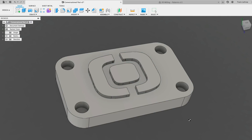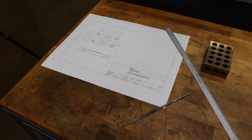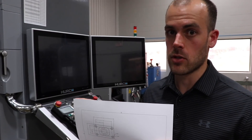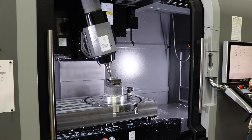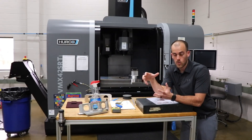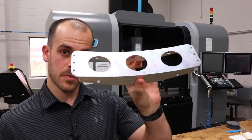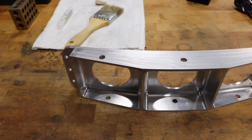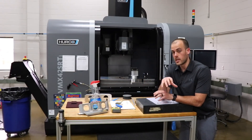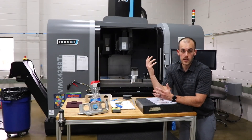In order to do that, I've modeled up a pretty simple part in Fusion 360 and generated a drawing. I'm only going to be working from the drawing itself to program my part using conversational control. The machine we're going to use is actually a 5-axis machine. If you're not familiar with that, it means you can do really complex parts or multi-operation parts with one setup. Here's an example of a 5-axis part, which would be really hard to do on a 3-axis machine, but it's really easy on that one. The part I've designed is pretty simple — we're only going to use 3 of the 5 axes, but this just happened to be the machine that's set up to cut aluminum.